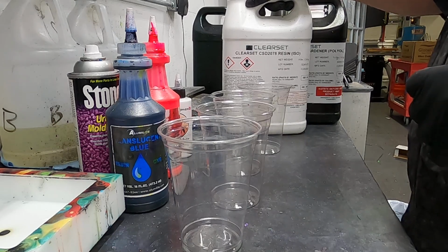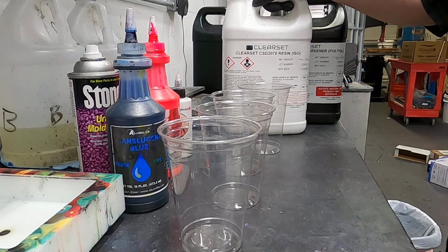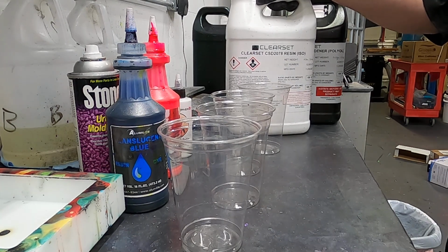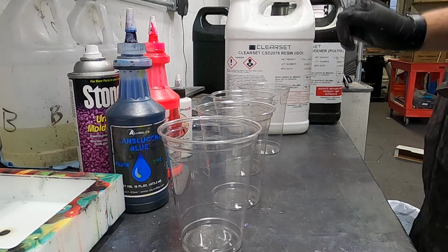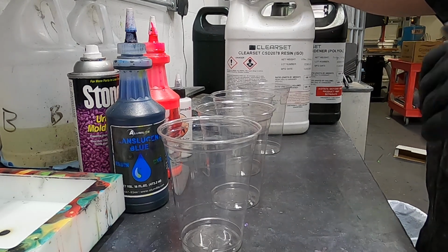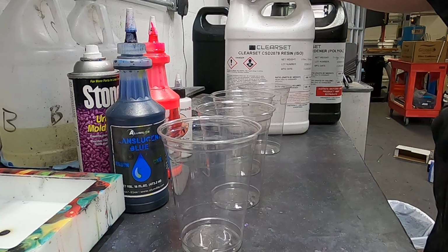They worked on one resin for us. It was a little bit too fast. We asked for a little bit more open time, and this is what they came up with. It's got an 18-minute open time. The ratio on this is wrong. This was one of the test ones they sent us. It's just a 1-to-1 by weight, so super easy to do.